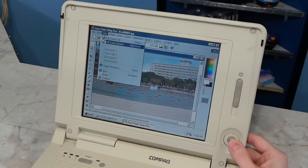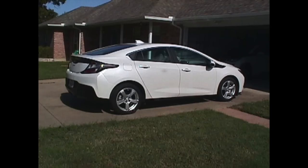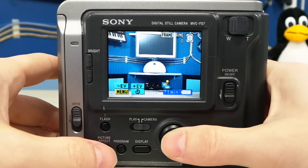That resolution doesn't sound very good, but really it wasn't too bad considering that at the time the typical screen resolution most computers were running was 640 by 480. A photo from this camera actually fills the entire screen on this computer because that's the native resolution of this laptop. In field mode you can see a lot of jagged edges, but the same image taken in frame mode looks much better. The reason field mode exists is that the CCD scans two fields a few milliseconds apart, so if there's any motion it will turn out blurry in frame mode. In fact, when you turn on the camera flash, it automatically disables frame mode because the flash only lasts long enough to illuminate one field.